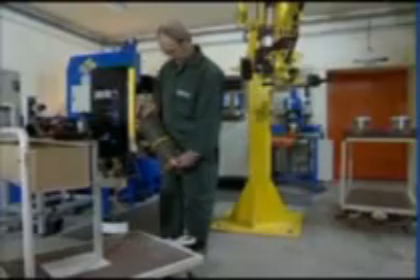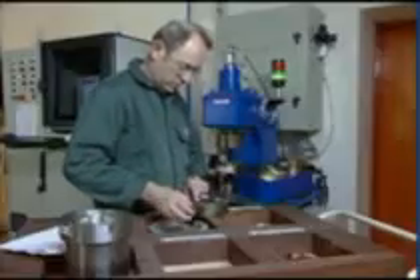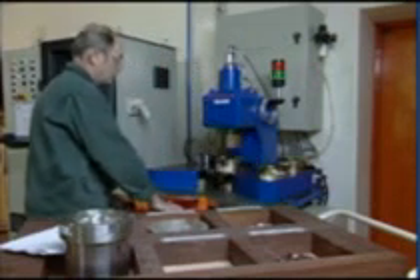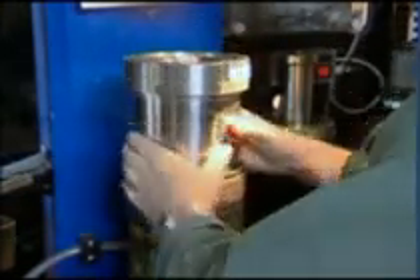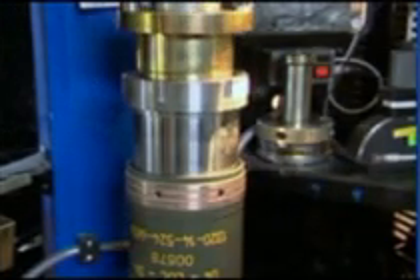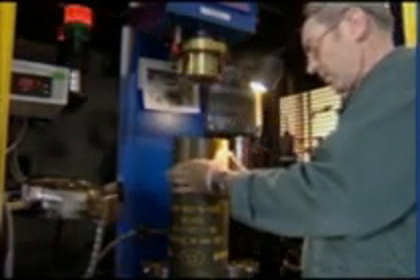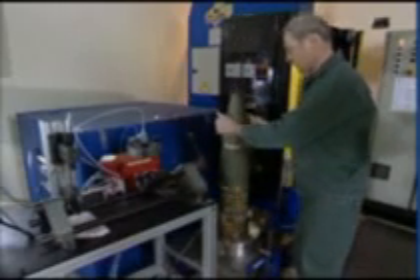The cylinder's wings are folded before the cylinder is placed in its carrier shell. The assembly of cylinders, base bleed unit, and carrier shell is carried out at one station. The cylinders are placed in the carrier shell. In the same machine, the base bleed unit is mounted. Finally, the shell's ogive, containing expulsion charge number one, is mounted.